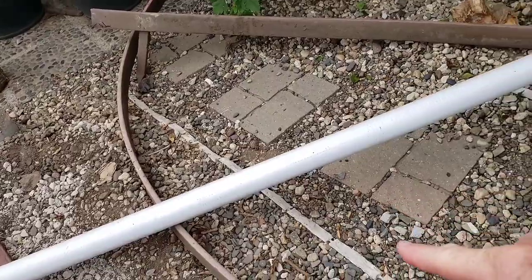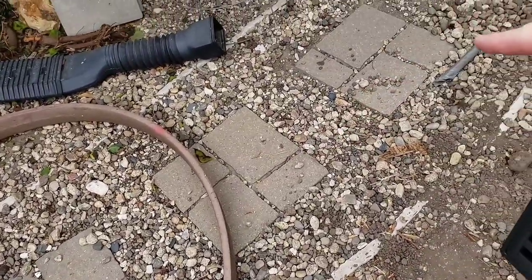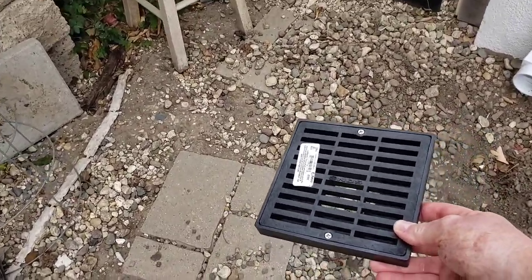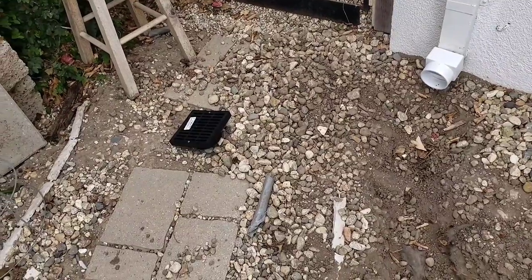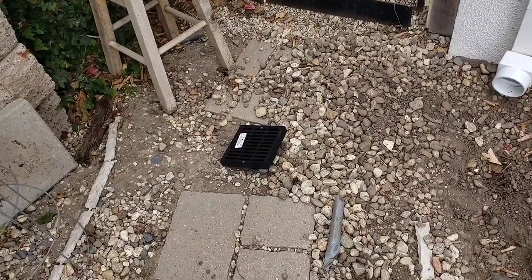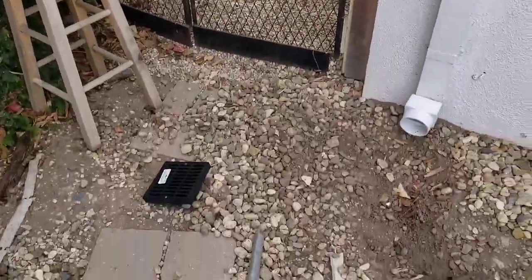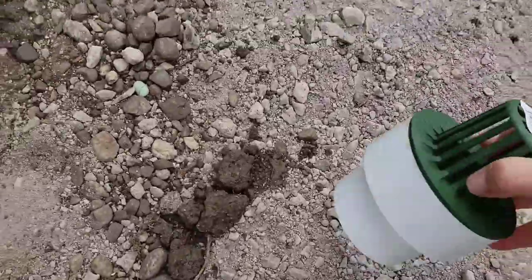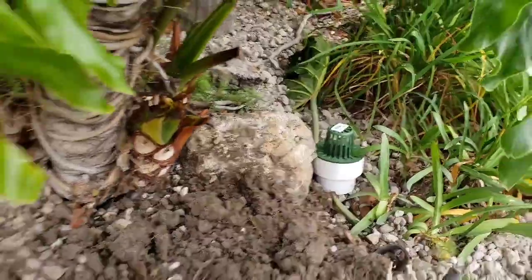This is kind of a natural little highway of water, and that's why I've designed it like this. I know it's messy and hard to see, but these rocks here prevent erosion. The pavers are set just below grade. I'm going to put the collection grate in between a couple of them and put some rock and weed barrier around it. That should catch a lot of the runoff from the side of the house. Then on the downspout I'm going to put a little Y-fitting right here and shoot it on down.